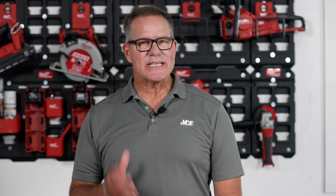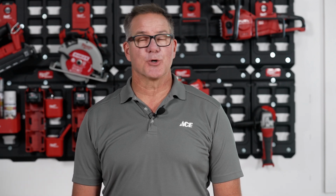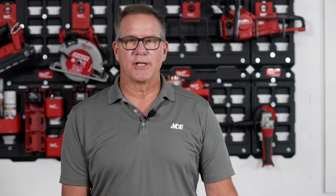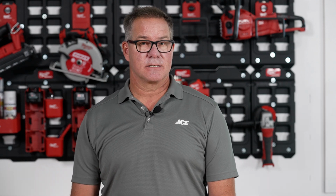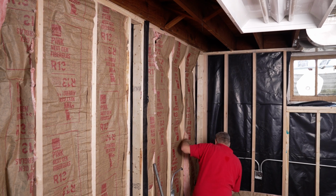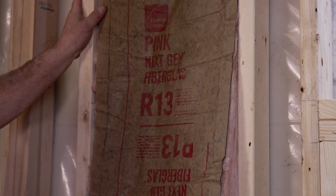Insulating your walls is maybe the best way to keep your home a comfortable temperature and keeps your heating and cooling costs down. There are different types of insulation that are rated for different climates. Check with the manufacturer to get the right R value for your area. Our demonstration was filmed in the Chicago area, and the recommended R value was 13.